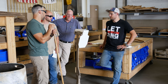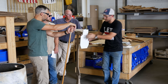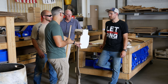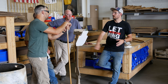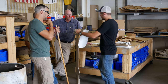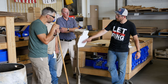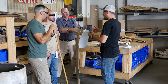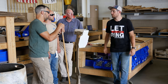Yeah. Very cool. And that's also why we don't mount them straight up. I mean, we could have done that as well, but then all of the load of that impact is going to get spread on where it's hit. So why not just do it like some of the companies that mount it straight up, but kind of floppy? Because that's not consistent. The idea is, we want the same reaction from this steel plate every single time. So the ones that are floppy, you don't know, it might go this way one time, might go that way. If there's a couple plates that can move side to side, they'll have maybe one hole in the middle and a hook or something, and they might have a little bit of movement, but even those mostly just rotate. And if you envision that, if it can just do that, you're changing that presentation of the target plate, and you're essentially creating those glancing blows we were just talking about if all it can do is move.